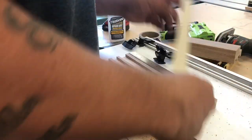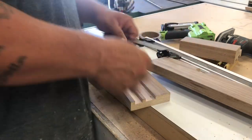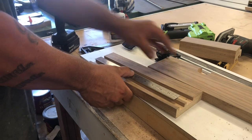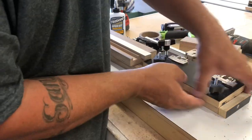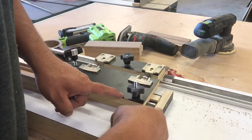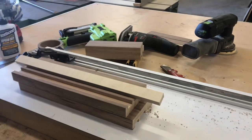Here's what we end up with. My bottom and my top are the exact same length, cut at the exact same time. The only difference is now I'm going to remove the thickness of one of these — which is an inch — from the bottom one. The reason is, when I push this in, the gauge is going to read from the bottom back. So if I want a six-inch offset, I slide the bottom over until six lines up with this side. On what I learned with doing these stop blocks, you can see the front here — I add this piece that'll go all the way against behind the fence so pieces can't slide behind it. But I want to be able to remove this so this narrower section can slide all the way to the blade. So right now I'm going to cut this one inch shorter and then glue this strip in.